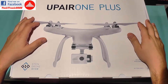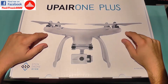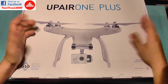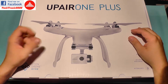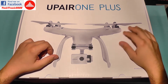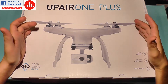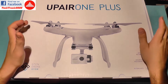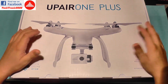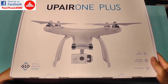Hello everyone and welcome to the first part of the review for the UpR1 Plus. There are several models of this quadcopter and they differ by the camera which has different resolutions. This is the 4K version — I'm going to test if it's real 4K or not. There is an analog drone which uses conventional 5.8 GHz FPV, and this is the digital version which uses a kind of Wi-Fi FPV but with long range, similar to the technology used on drones like DJI. It has good range and good video transmission quality as it's HD and digital.